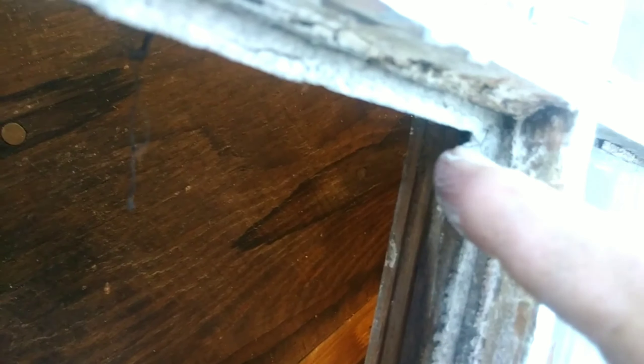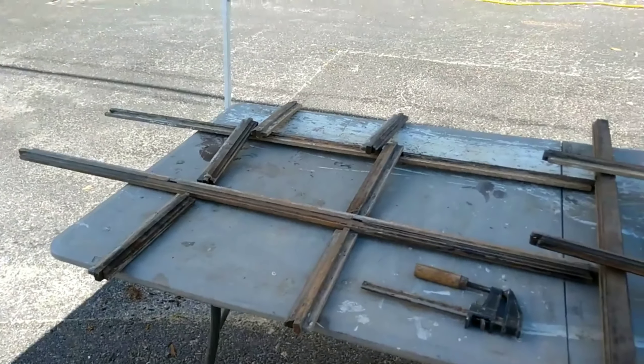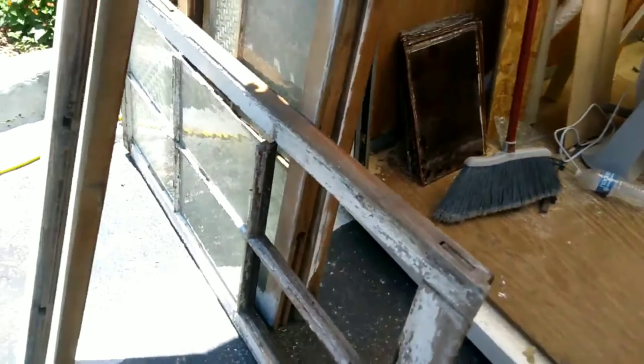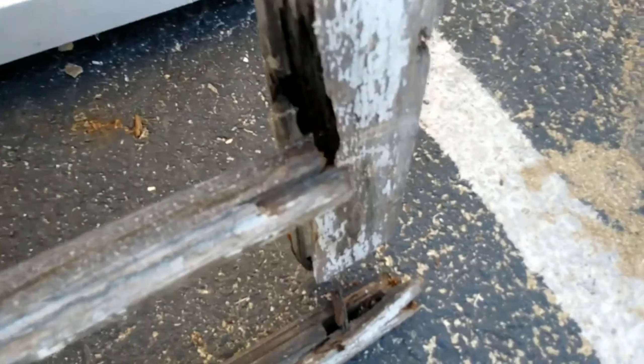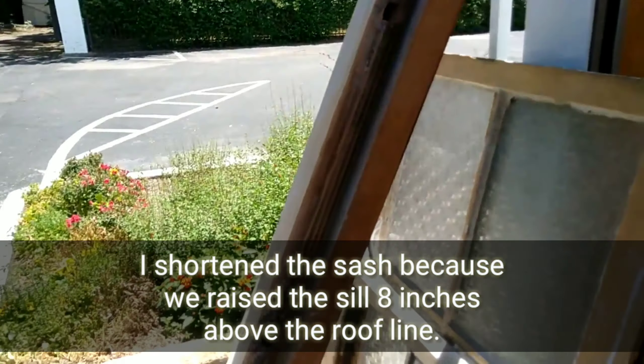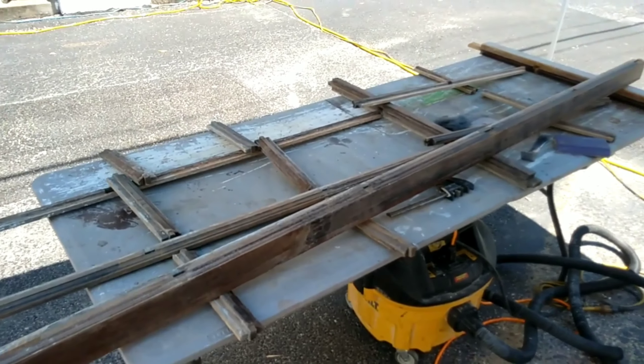I just think that's the coolest thing ever. So Steve Quillian is such a window nerd. The sash I took out of the opening today — it's just a skeleton. I took all the glass out and put it right there for the time being. The bottom of the sash looks like that, and I had to shorten it. So what I did — I took these legs off, cut it to the length it needed to be, then mortised a new hole. I'm going to have to put a new rail here at the bottom. That's what I'm working on at this moment.